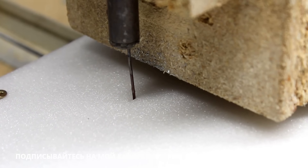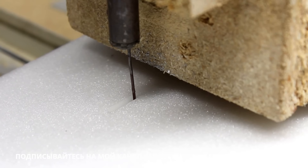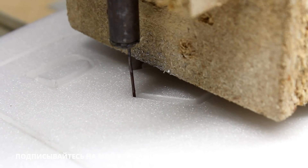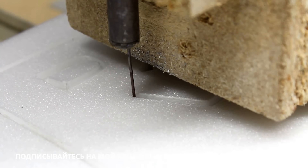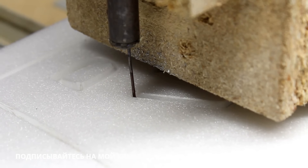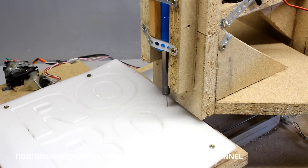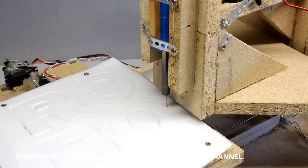The 3mm plate of depron processed here can be cut very easily. The material isn't cut with a router, but by using a soldering iron with a 1mm copper wire at its tip. Consequently, processing depron with that CNC machine is more quiet. The length of the copper wire should be chosen in such a way that the temperature is just enough to melt the depron — that reduces the bad smell of evaporating plastics. The width of the cutting line is approximately 2mm and there is almost no side load on the tip of the soldering iron. Depron is cheaply available and it is a proper material to demonstrate how a CNC machine works.